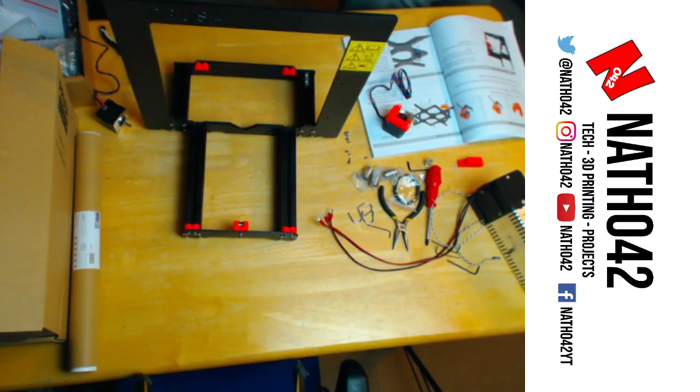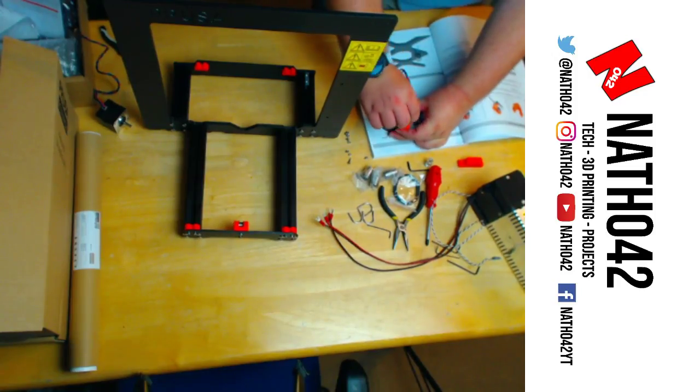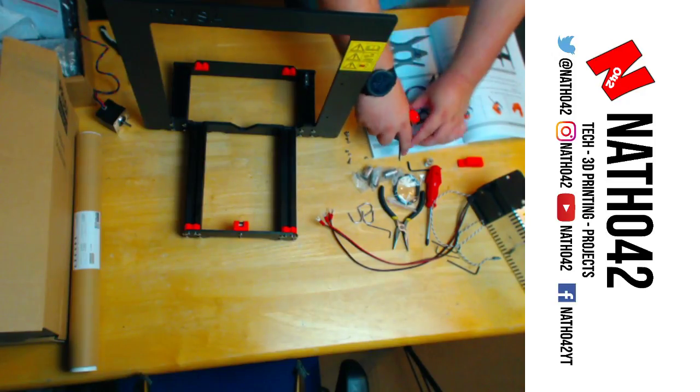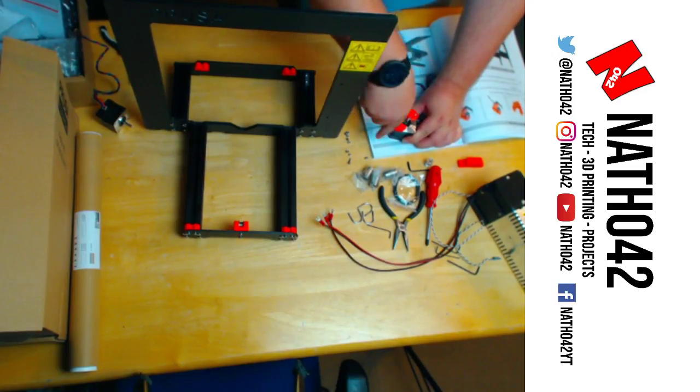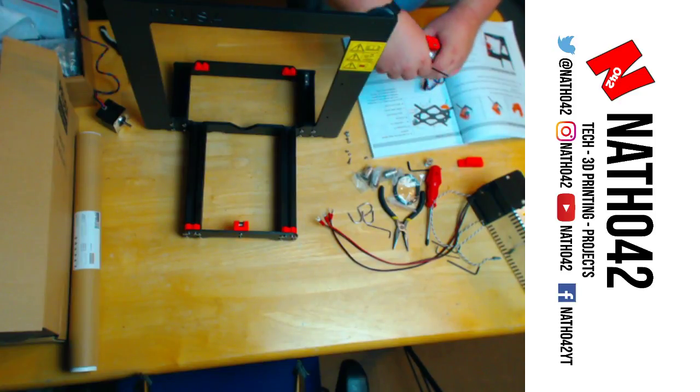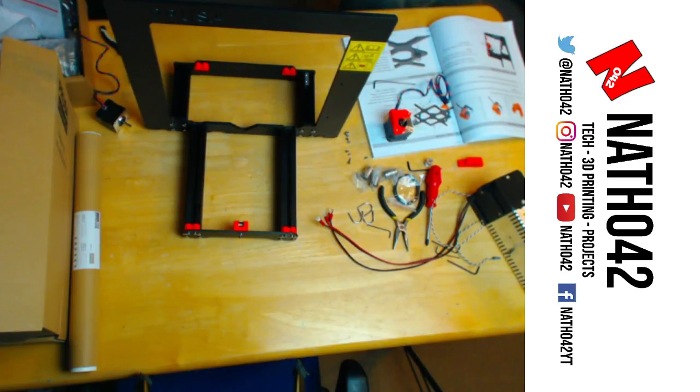It should say don't over tighten before you do these things. Using 2 M3 screws, tighten the holder and motor together. Yeah, it doesn't say don't tighten. You can do it like this for now. Okay, that'll do. I'll do this one as well. There we go, perfect. That is that. So we have the motor now already. They are both done nicely using 2 M3 10 screws to tighten the motor and holder together. Yep. Now this one needs to go here.